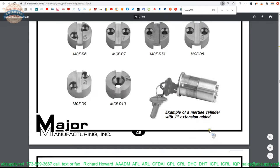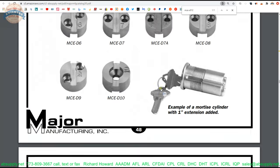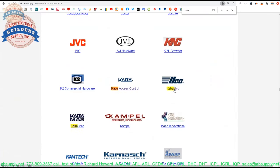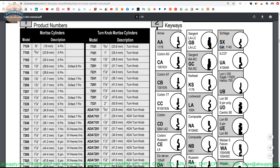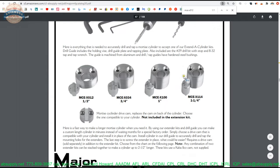So that's what all the drive cams look like, and a finished example is right here — that's what it looks like. Works out really well. I had a client call needing a Schlage FG two and three quarter inch mortise cylinder, and I was able to build that for the client. I sold them a composite Schlage C-through-K keyway — the composite broaching takes C, E, F, G — on a Kaba Ilco cylinder, inch and a quarter length, with the appropriate extension, and shipped it out three days later.